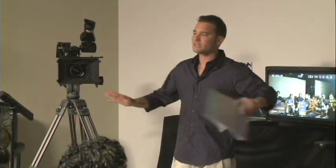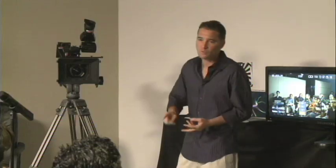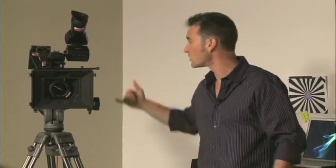SMPTE timecode. Number two: genlock. A lot of switchers out there are auto-genlocking right now, and a lot of them are not — sometimes it's a feature you can turn on and off. If you've got a camera that accepts timecode and genlock, you're light years ahead in putting together a successful multi-camera production. Number three is its remote input. You can connect an RMB-150 or an RMB-750, which allows an engineer to sit at a row of paint boxes with a monitor and change the iris, change the colorimetry, change the menu settings — really make it happen all at once with several cameras through the remote input.